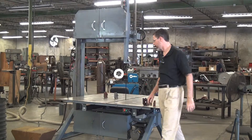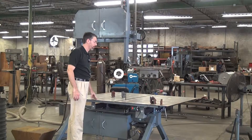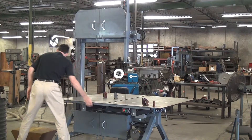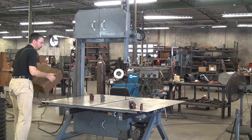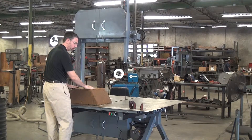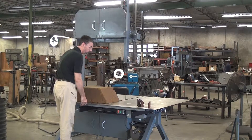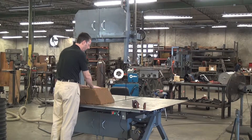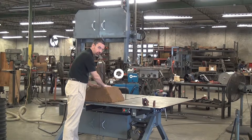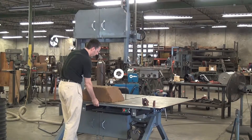As far as safety, the best way to stay safe with the bandsaw is to keep your hands away from the blade. When making a cut with this machine, my preferred approach is to place the workpiece on the table and then push the table to make the cut. There is often a temptation to put your hands on the workpiece, but depending on how you place your hands, you expose yourself to additional risks. Put the workpiece on the table, push the table.